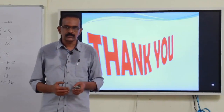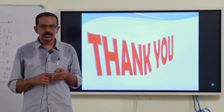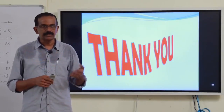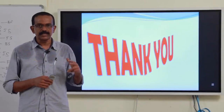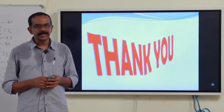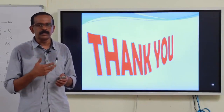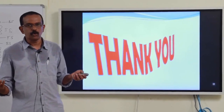To summarize, today we discussed the instruments used in leveling (dumpy level and leveling staff), the temporary adjustments of the dumpy level, and key definitions: reduced level, benchmark, back sight, foresight, intermediate sight, line of sight, height of instrument, and change point. We also solved two problems. Remember: if the question states when the instrument was shifted, that reading is foresight and the next is back sight. On a sloping ground, the highest reading before a sudden decrease is the foresight.